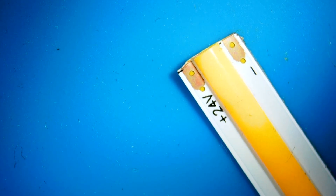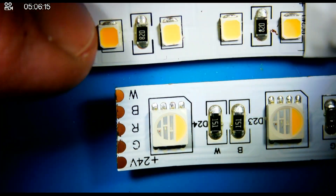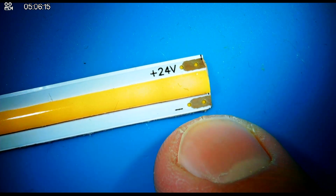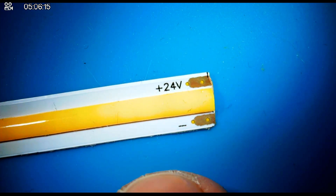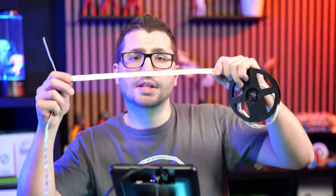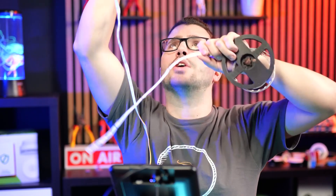Depending on the type of LED strip you need different wires. Here I have an RGBW strip — red, blue, green, and a dedicated white one. There are RGB strips as well, then you need four wires; for RGBW you need five. There is also an option for just a fixed color, typically white — can be 4000K, 3000K, warm or cold white. The RGB one does not have as many chips per meter as this COB LED strip, which has over 700 LEDs per meter so you do not see the single chips.